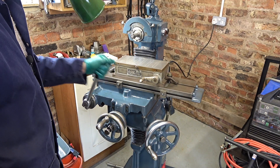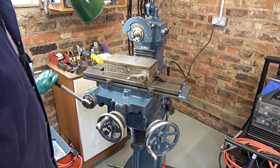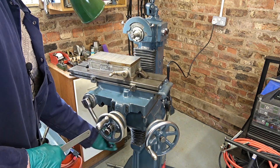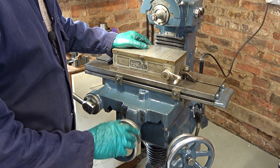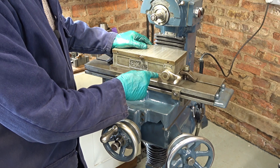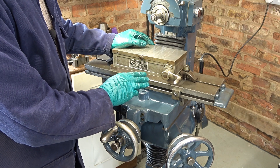It's quite a lump all together. That's on there for display purposes only because I need to clean it up a bit yet. This table has an 8-inch travel and this is a 10-inch magnetic vice — so you cannot clean up the full surface on this grinder. Here's a question: how do you lubricate these? I've got another Eclipse magnetic vice that has a screw in the bottom — take that out, put some oil in, pop it back. But this one doesn't seem to have any way to do it, and I'm certainly not going to take it apart because of all the warnings about losing magnetism.